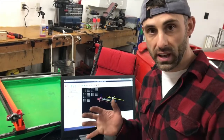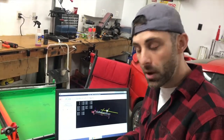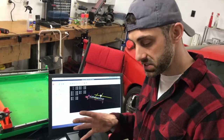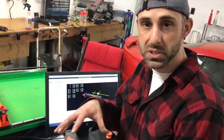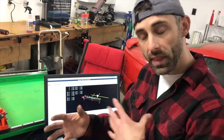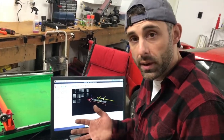And that is essentially what this is, just the implementation of G code. A part on a 2D axis basically shows that the motor should be running at this speed for this distance until it needs to stop, and then the other motor runs, or they can both run concurrently if you want to do a curve or a diagonal. So that's all that G-code is.